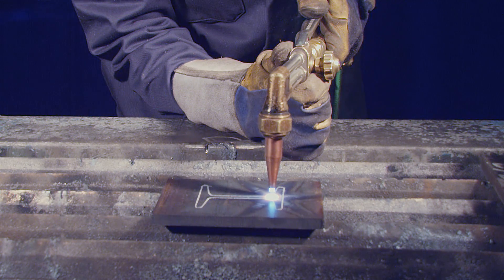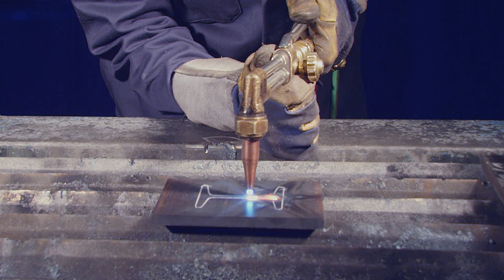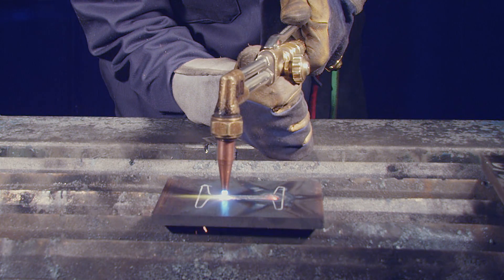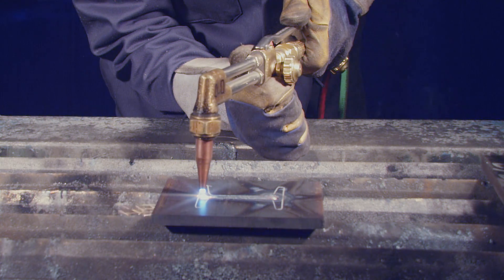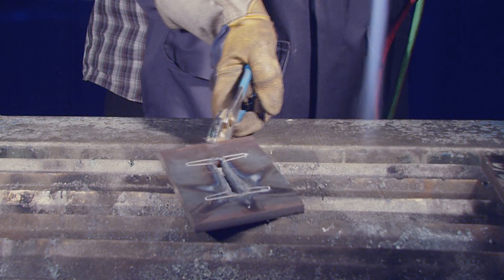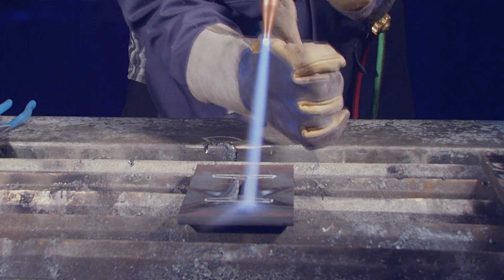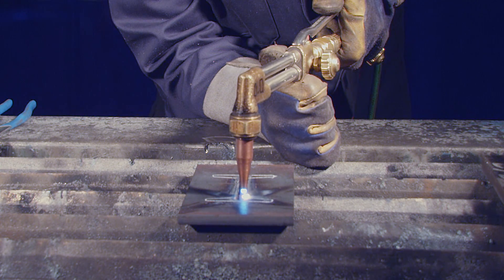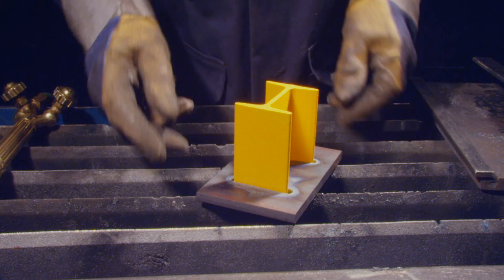Keep the torch perpendicular or ninety degrees to the plate. If you are using the traveling torch method, proceed to cut out the web portion of the S-shape. To produce the optimum results, the idea is to remove all the chalk lines. After completing the web section, move the coupon to the position you find most comfortable. You can then use the edges created to start your cuts in the flange portions of the S-shape. An alternative method would be to use the still torch procedure and cut the shape with one continuous cut. The three inch S-shape should pass through the hole you have created with little resistance.